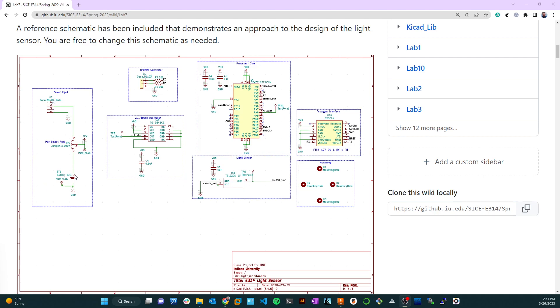We're going to go from left to right as we add this stuff. One thing I want to point out is the power infrastructure here. We're going to add a battery — a coin cell, a little three-volt coin cell. That battery goes into a jumper block, which is just a normal three-pin header. I can put a jumper between pins one and two to power the system off the battery, or remove the jumper to leave it unpowered. There's also another jumper that runs to a four-pin JST connector.